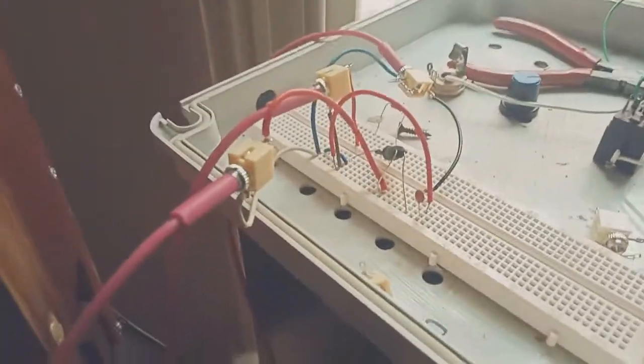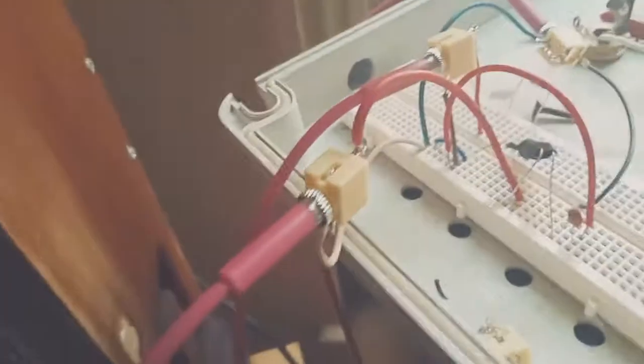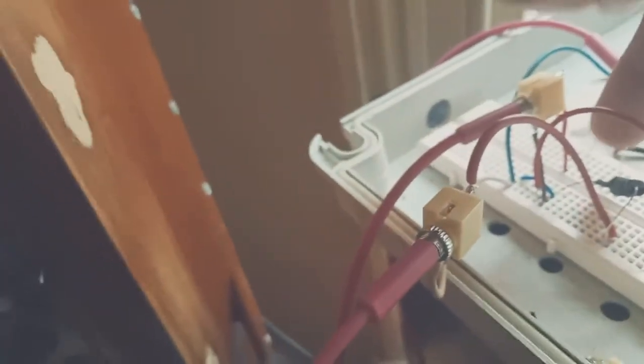Right, well, we kind of sped ahead with this circuit. There's the little Vactrol in there that we cleaned up, the black thing. Here's still our input with a control voltage going in there that goes through the resistor into the positive leg of the LED inside the heat shrink. Negative leg of the LED goes to ground.